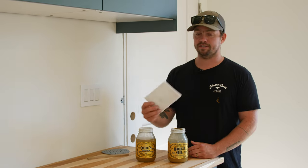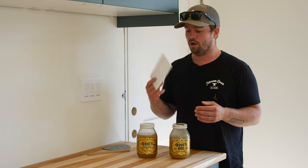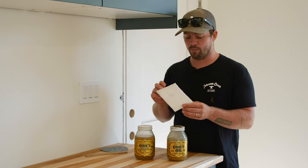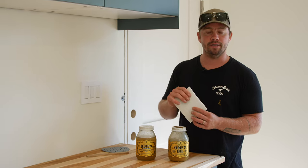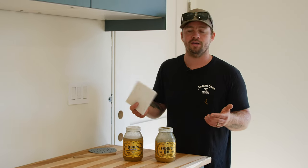A couple of things we're going to need for applying this to the wood — these Scotch-Brite pads. Odie's Oil sells them on their website, and we'll post a link in the description, but you can also buy them at a hardware store or home goods store. The white color pad is the one we use — technically it's a no-grit pad, but you want to use a pad that is a higher grit than the last sanding you did. Our last sanding was 320 grit, so you could use something like the 500 grit, which is the light gray pad. The white one is just what we use and we've been really happy with it. The other thing you'll need is a stir stick.